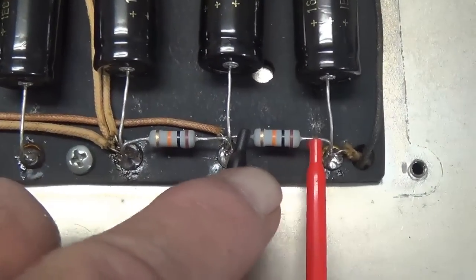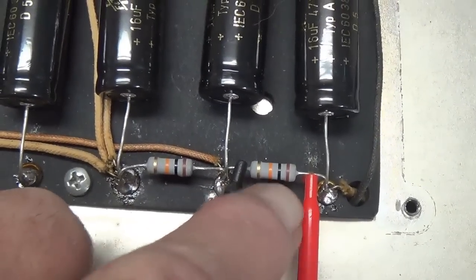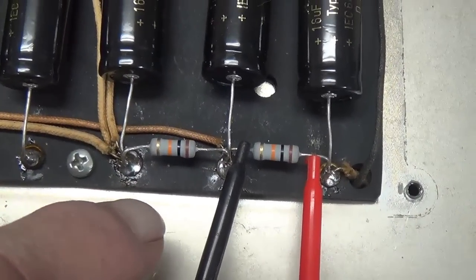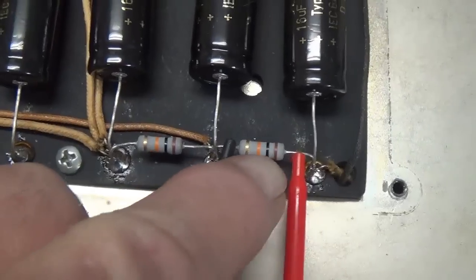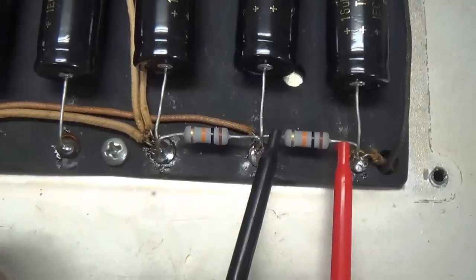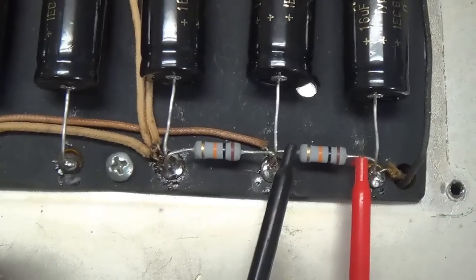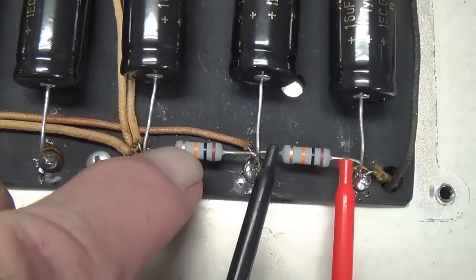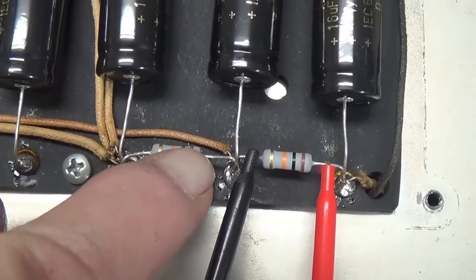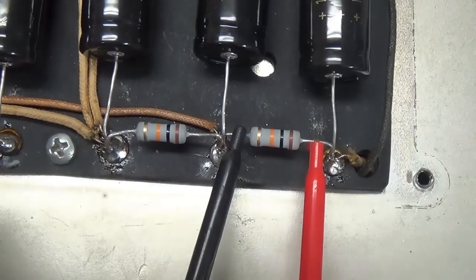So you ask, if they're so vastly superior, why don't we replace every resistor in the circuit with metal film resistors or metal oxide resistors? And it's simply because the purists feel that these yield too sterile of a tone, and that the carbon-based resistors yield a more vintage style of tone. Whether that's true or not, I don't know exactly, but I just know that I'm going to leave every carbon-based resistor I can in the circuit that checks out properly, and only replace those that don't.